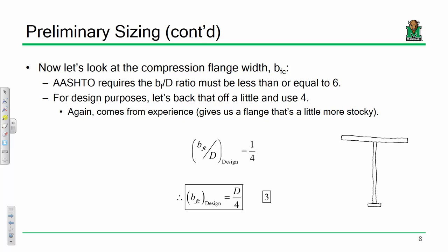The question doesn't really go along with what I'm talking about. I'll explain. I totally agree with you that if you have a composite deck on a steel beam, it's going to behave differently than the steel beam by itself. Okay. What I am also saying is that in a bridge scenario, it's not one or the other, it's both. We have to assess the capacity of the girder in its non-composite state and its composite state.